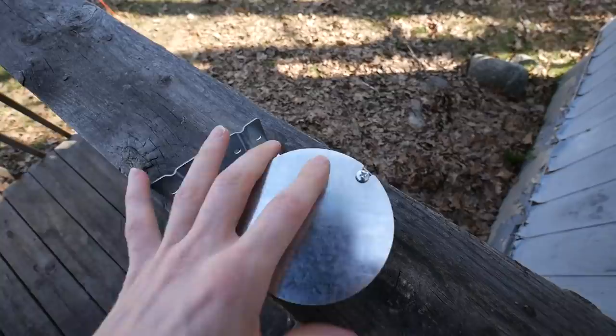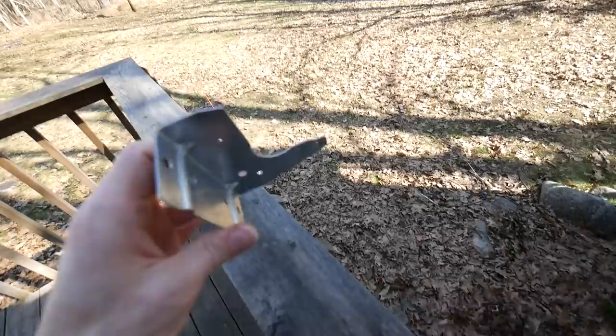Because we want to do this house right and be prepared for the future, I went ahead and listened to you guys and picked up a ceiling fan box. This is a special box — this bracket will go up in the ceiling, and this box hooks to it. It's supposed to be able to hold a 70-pound ceiling fan.